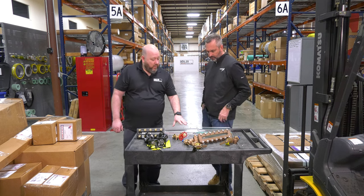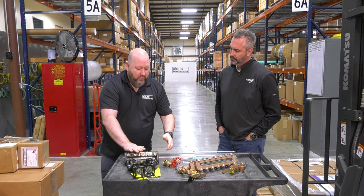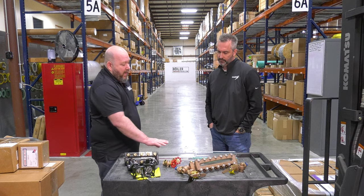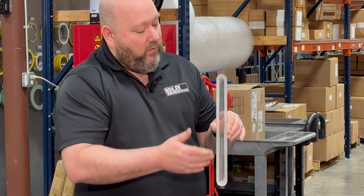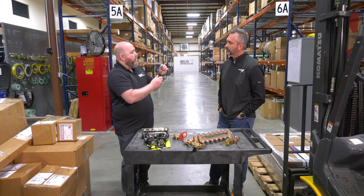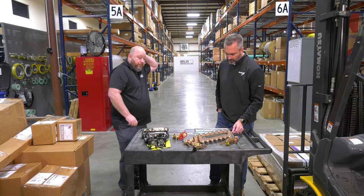Then we go to this type of glass — these heavier-duty armored sets. This thing probably weighs 25 pounds; it's got some pretty good heft to it. The ratings for these on boilers can go up to five or six hundred psi pretty quickly, which covers most boilers out there. They've also got different types of glass that go in them: this is a reflex type that actually refracts light, so when water is behind it it looks darker so you can see it. This type right here is a transparent glass used on armored gauge sets where you can see all the way through, and they may have a light behind them to light it up. Both types are actually the same size and can go in the same armored set — you just need to know which type you have.